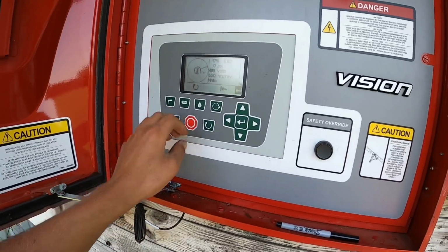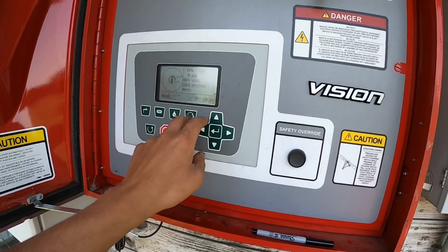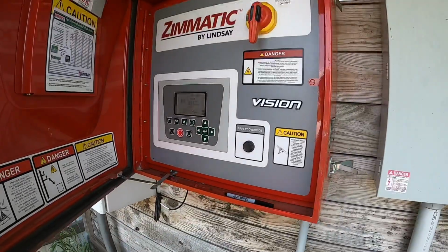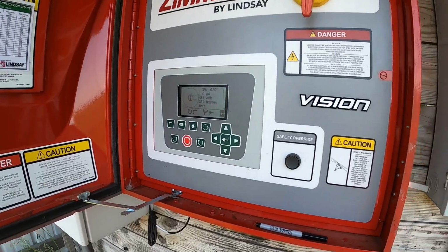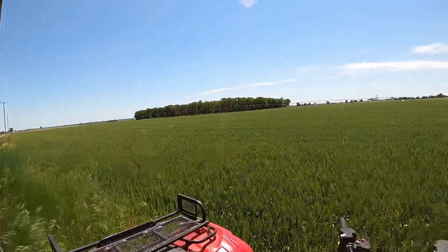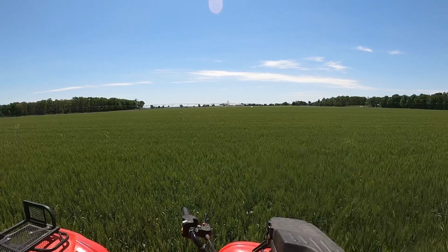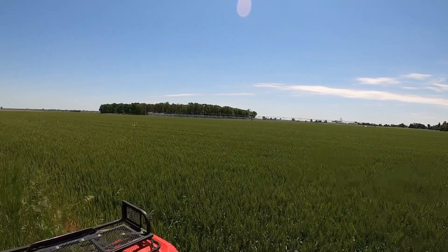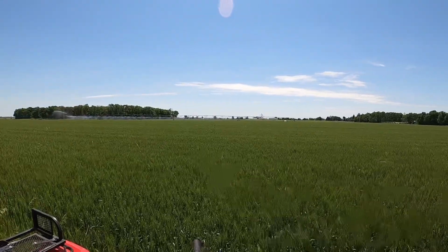So let's go ahead and set the direction. Yep, delay, water on, should be a restart delay. Okay, go ahead and start it, set the stop to 70, and putting on 8 tenths, and it's about halfway, close to halfway around. I'd say it's going to take about 16 hours yet for it to get up to the stop again. Let this get up to pressure, and it should turn on here in the next couple of minutes. And there we go, up to pressure, everything looks good, no plug nozzles, end guns on, awesome. Let's hope we don't have any more issues.